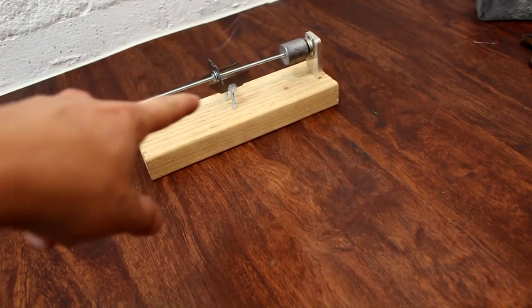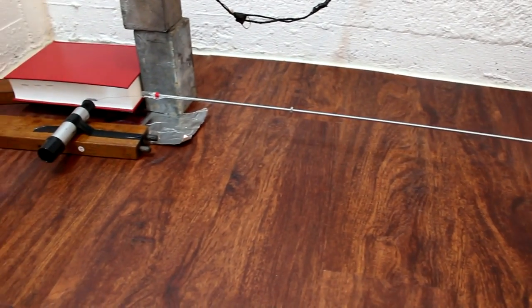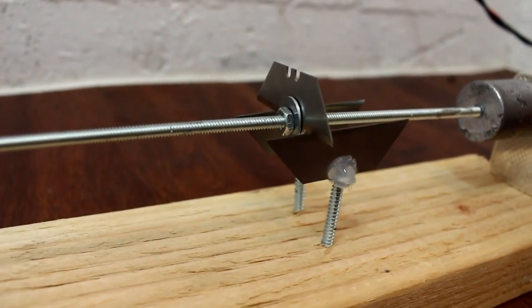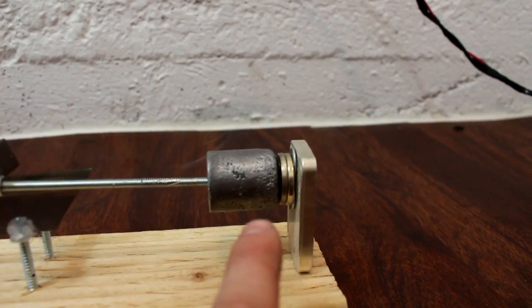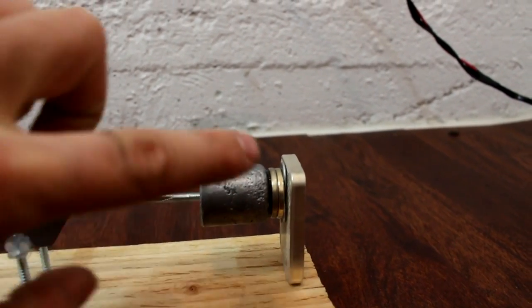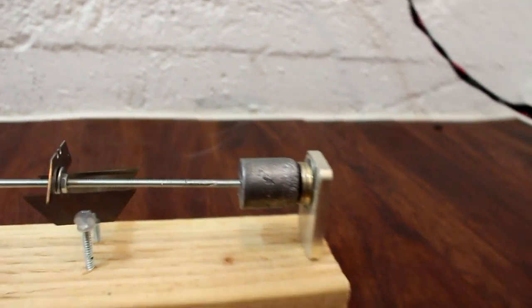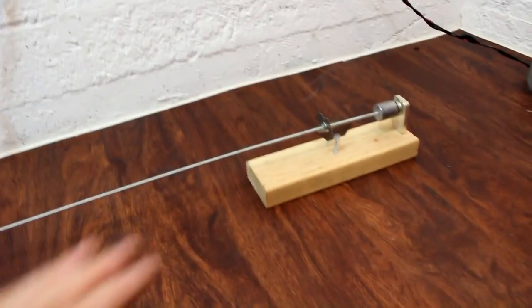In fact, I've got a device over here, which is incredibly sensitive. And so here it is. I've built a balance beam with an incredibly long bar, as you can see here, balanced on a knife edge. Those are razor blades there. I've got a magnet and a lead counterweight over here, along with a bar of silver. This is to dampen any motion so vibrations even out quickly. You know, eddy currents only occur when there's relative motion, so if there's no relative motion, it'll just settle out.